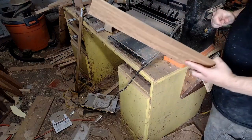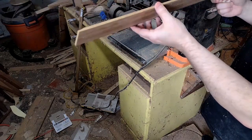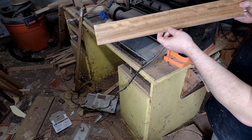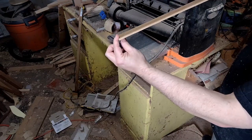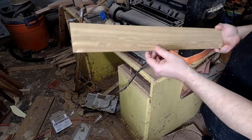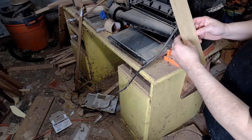Some things I was talking about as to why we over-cut: I did not look at the grain prior to doing this — distracted by doing the camera thing. Here is our fretboard. This is extremely light, I mean it feels like you're hardly holding anything. That just means the neck is going to feel much the same way. This stuff is terrible. A couple of reasons why we over-cut: planers have a habit of over-planing on the edges, just dive in and dive up.